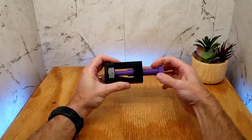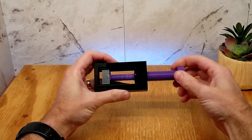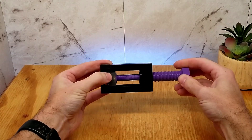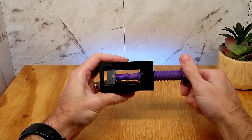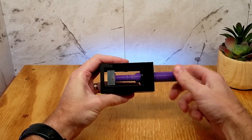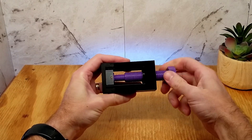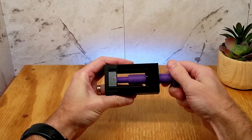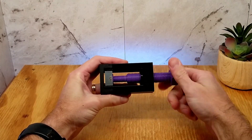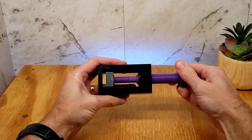There's something quite eerie about this. From two coarse thread screws — one at 10 threads per inch and one at 13 threads per inch — I'm able to achieve the equivalent of having a roughly 43 threads per inch screw. Something like this could be used for fine machinery adjustments or high clamp forces. If you want to try this out for yourself and hurt your own brain, you can go to Stanford Prime on Printables or Thingiverse to download for free.